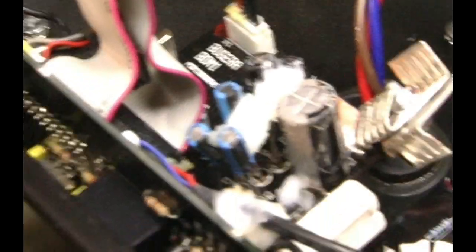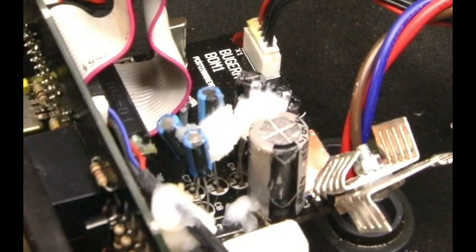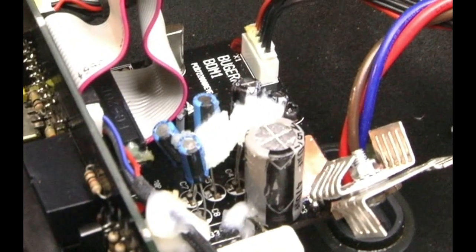The caps were on the way out, but that BDM board was not the cause. It did seem to make the switching worse, and once I rebuilt the board it got a bit better. But sure enough, if you left it on, instead of 20 minutes you had to leave it on for several hours before it would start switching again. So replacing the caps is a good thing to do because they seem to be running hot and shorting out a bit inside — but that's not what caused the switching problem.